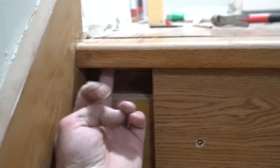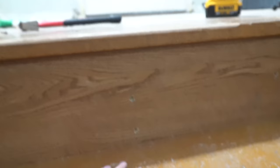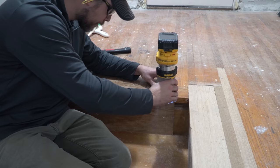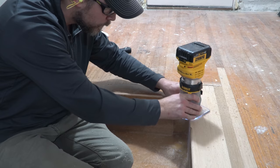Eventually we're going to redo the stair treads and risers, and this piece was going up behind this nosing strip — I broke it out now so that I didn't wreck this in the future. This piece is just temporary for strength so that when you step on the edge it doesn't want to snap off where I just put those nails in. This will eventually come out and be replaced with a full-length, full-height riser. In the garage I put the round-over on starting at this corner because I knew I couldn't get all the way to the corner. I rounded over all the way up to here and quit because I wanted to get these installed and exactly in place with each other, so now I can finish routing this round-over in this corner and it'll match perfectly.